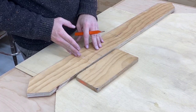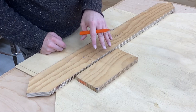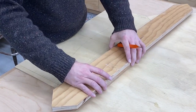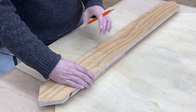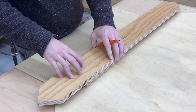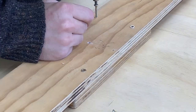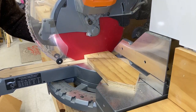I'm going to be cutting this piece right around this little area over here. That way, when the dome is completed, I'll be able to disassemble this piece and slide it out easily. Before I actually make the cut, I'm going to mount this piece underneath temporarily because it is going to be what reconnects everything perfectly. So instead of trying to figure out the perfect placement after I make the cut, I'm going to screw this in first, then take the screws out so I'll have the holes already in place. I'll cut it and then I can reassemble it very easily.